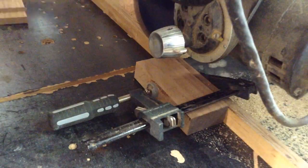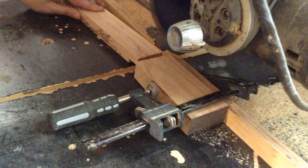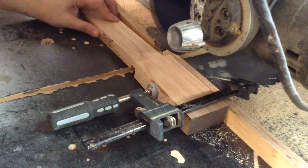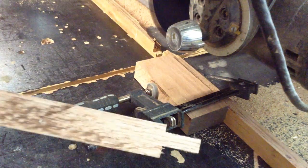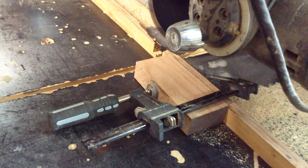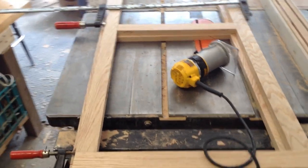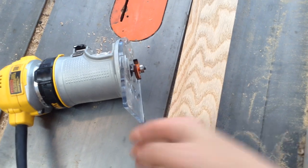My mortising machine cut these a little bit off center. You could see I'm doing the bottoms first and then I'll cut the tops — that is sometimes an issue with that mortising machine. I wasn't paying close enough attention. You could see it is a little off center, but that's okay — you can adjust it for the radial arm saw. It's a little bit longer because you have to cut two different depths, but it is doable to get it lined up. And then this is going to be the end of this video. I'm going to start with finishing the doors next video, and that should be the last one for this series.